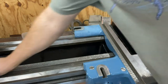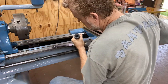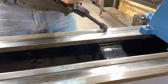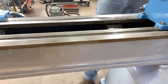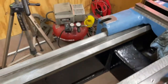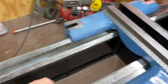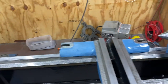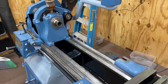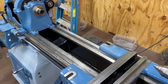After thinking about it I'm going to do the same on these bearing surfaces. I think that looks a little better and will hold oil. It's probably reasonably flat enough. I didn't take off much metal and hopefully it'll just retain a little bit of oil. I think that looks nicer — it'll hold the oil better than that flat smooth metal that was worn before. I have some way oil on there now and it moves nicely. Probably should have done all that before I put the bed on, but it worked fine.